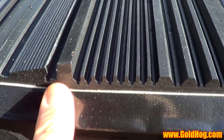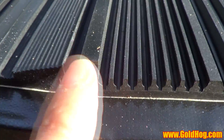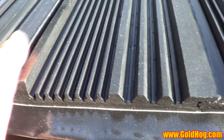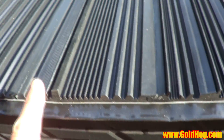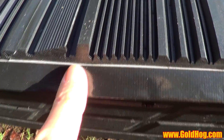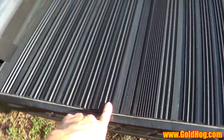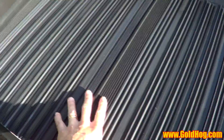I'm taking a River Hog, cut way down — almost even with the ramp — into a throw situation, so there won't be a lot of turbulence in this mat. I've got one River Hog cut, then one, two, three Talons, then a River Hog cut, then Talon, Talon, River Hog — we repeat that pattern all the way up the mat. On our basic flow testing, this is what we've determined to be good in most dredges. This way we're only treating the bed load, not creating a lot of turbulence. We've got big open grooves for big gold plus a lot of areas for fine gold too.